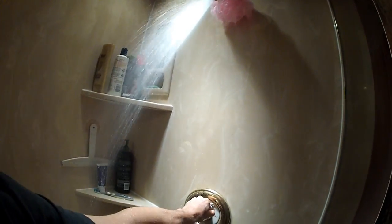I've been researching a problem with my American Standard shower valve, and I've seen a lot of people with the same problem. The issue is when you get your shower up to the temperature you want, it starts water hammering and won't stop. My temperature is about right here — as you can see, that's not gonna work, and even if you slowly bring the water up to temperature and then turn it back, it still won't work.